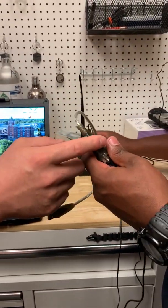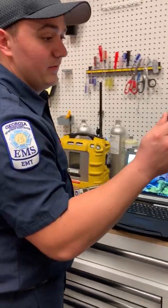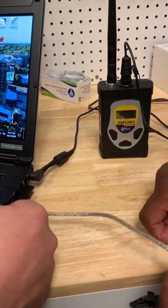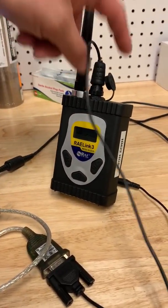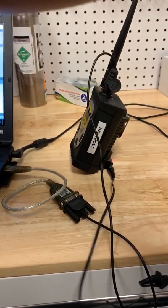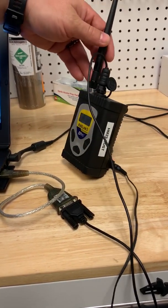In the past we've connected to the serial, but for some reason we have not had luck with that. It's been better with using just USB. We're going to hook the host USB into either port — it doesn't matter which one. When setting up our host, we make sure the cord is plugged in and we also want to make sure we have power plugged into the wall. If this is not plugged into power, it will not work as a host.